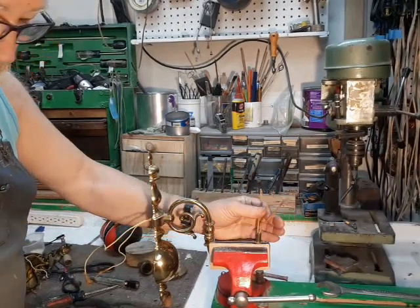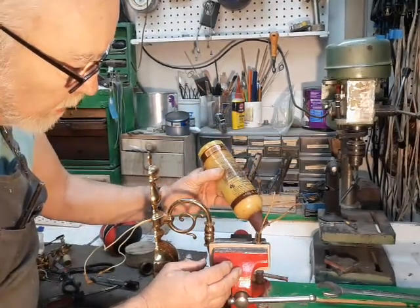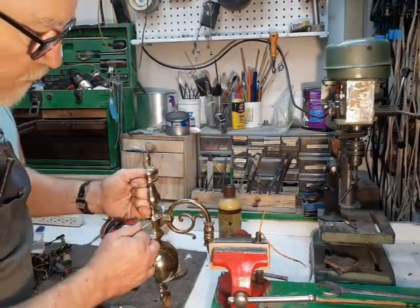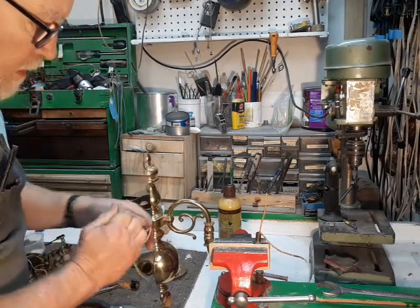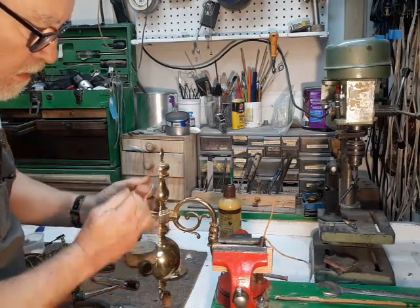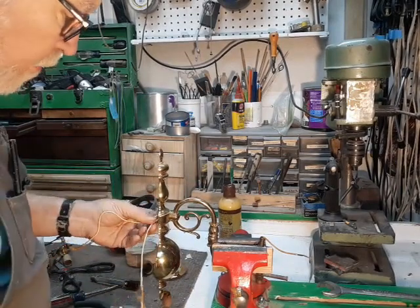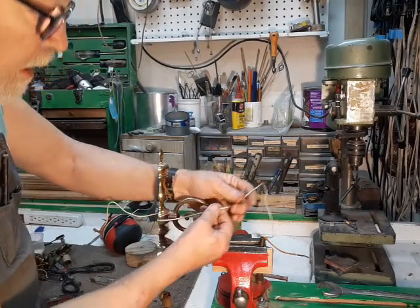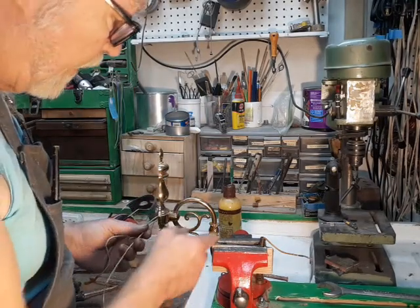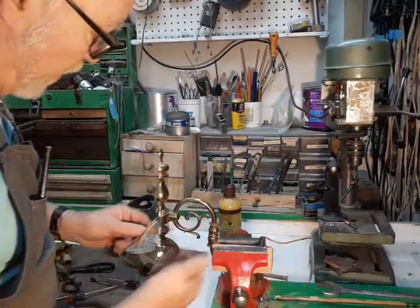First, I want to get one of these wires out of the pipe just to make it easier to pull, and a little bit of lubrication in the form of furniture polish. Bend one down, keep it in place. I'm running into a problem here — I want to point out this cloth-covered jacket on the insulation is peeling off. This one is coming out clean, which means that somewhere inside here there's a bunch of this fuzzy stuff. That could be a problem later on.